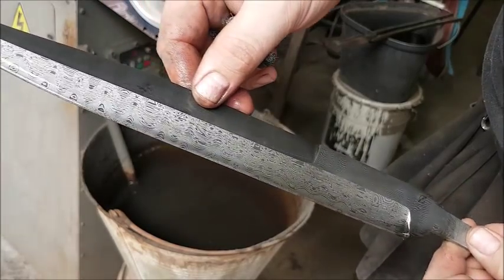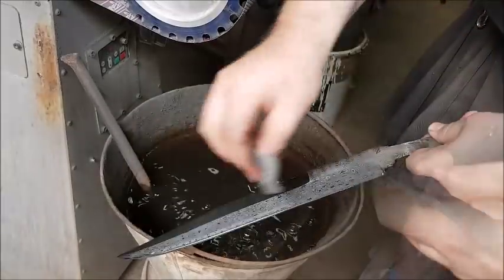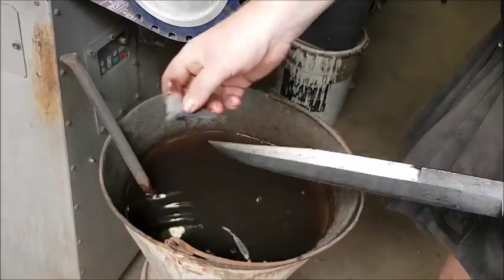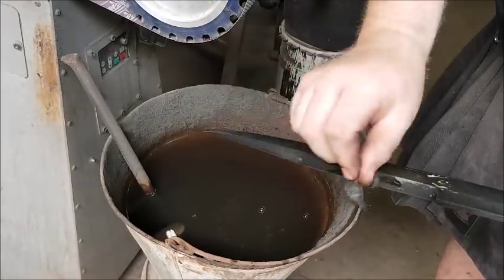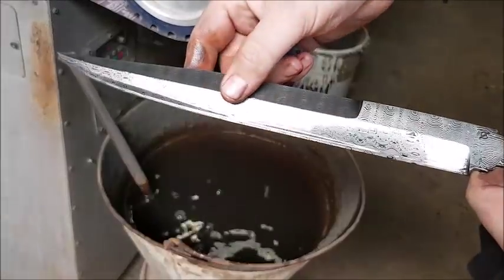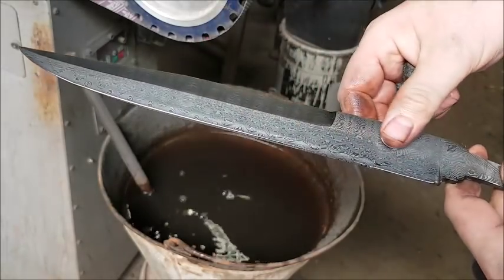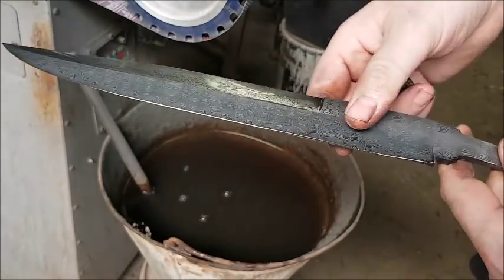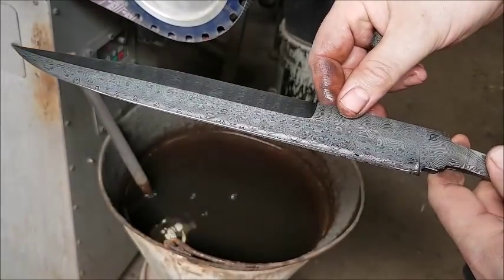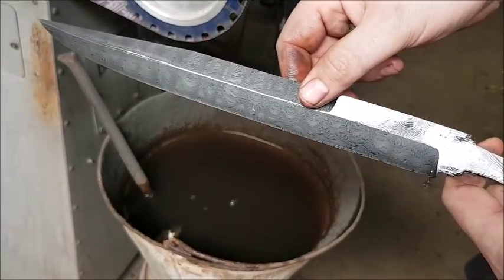This is quite nice — I'll repeat this four to five more times. After the second etch I'm really starting to feel the layers. The reason I do it this way is because if you just leave the blade in the acid the whole time, your Damascus gets a little fuzzy. By doing it this way, the delineation between the different layers stays crisp.